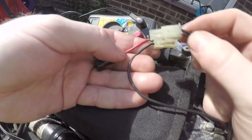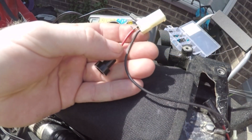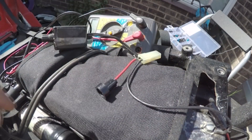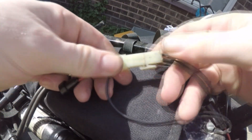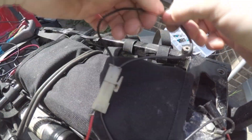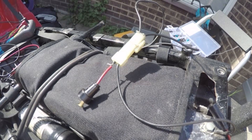What I'm going to do now is show you how to actually connect two wires together properly. That's positive, that's negative — but if you notice, both are black, so we need to work out which is which. I'm going to put one and join, put one and join, so that way I know which wires are going to which and I won't get confused. Let me get my solder and iron now. And obviously my good old heat shrink rings — I'm going to do this slightly different.